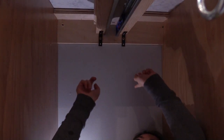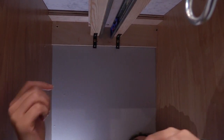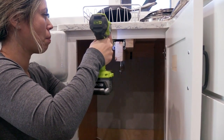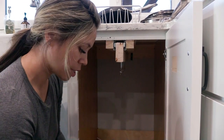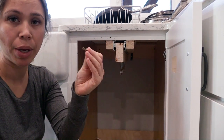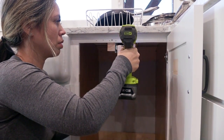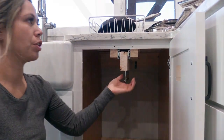The brackets are going to transfer some of the weight to the back of the cabinet. I've got screws into the top of the cabinet and I'm also going to put a couple of screws into the face frame to transfer some of that weight. Everywhere else I've been using a cabinet screw, but here I'm using a trim head screw so I can go back and fill it and finish with some paint. If your wood is splitting, make sure you pre-drill your holes.